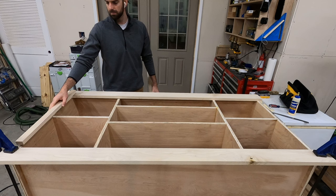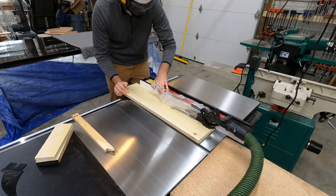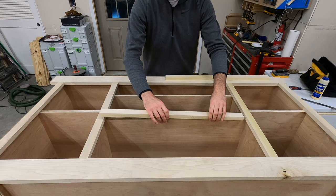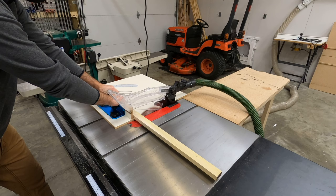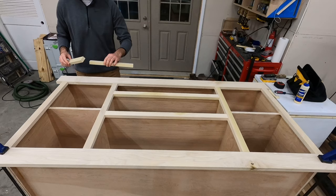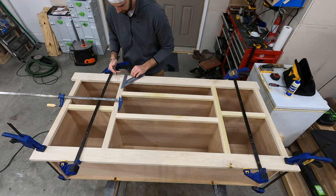I began laying the top and the bottom piece of the face frame on the cabinet, then measured the distance from top to bottom, cut those pieces out on the cross-cut sled, ripped them to width, put them in place, and then did the same process for the horizontal shelf pieces across the front. Poplar is a really good choice for face frames — it's not overly expensive, and it primes and paints very well, which is why you'll often see it used in applications like this.